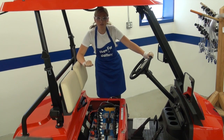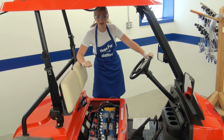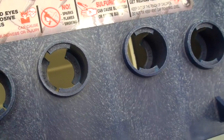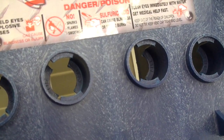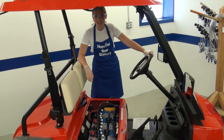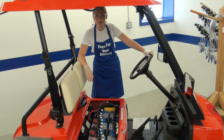I'd like to stop for just a moment to mention a special battery vent opening used in all Trojan Plus Series batteries and in the U.S. Battery 12 Volt RX. This is what a typical battery vent opening looks like. This is a special battery vent opening. When inserting the valve into the vent opening, you will need to be careful to ensure that the float on the valve clears the internal obstruction. Damage will occur to the float if you push it into the vent well before it clears the obstruction.